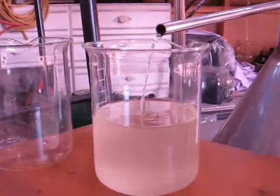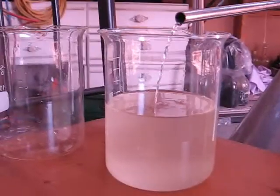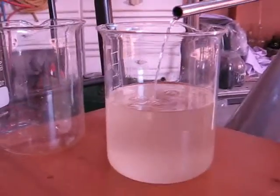As the separator is filled with warm water in advance, the collected oil floats to the top and collects in the narrower neck of the separator. We pause on the oil bubbles so you can see how they rise to the top and into the neck. We maintain the water level at the oil outlet by adjusting the steam flow, so the oil flows out through the outlet pipe at the top and the lavender water or hydrosol, which is heavier than the oil, exits through the hose at the bottom where it is collected in plastic buckets.